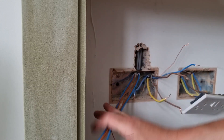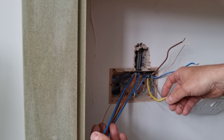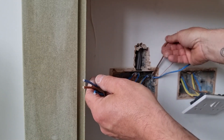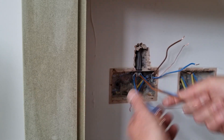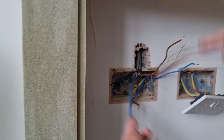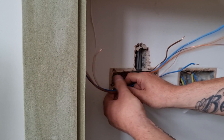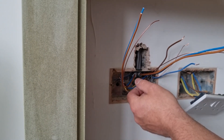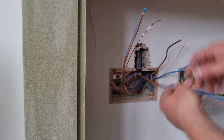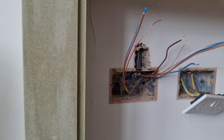As you can see, these are my two new cables and these are the existing cables. We've got one cable - that's one leg of the ring - and that's the other cable - the other leg of the ring. In order to add these two new legs, we split them up. Then we just put one set of cables in the back of the box in connectors - oh, power's up isn't it? Those two go into the socket there, and it's as simple as that.